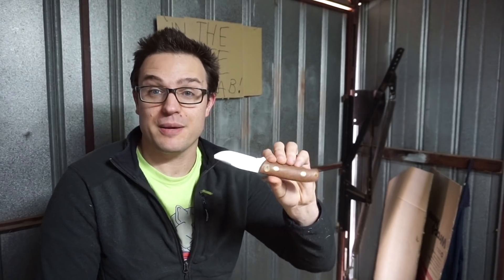What I'm going to do is put a 17 degree polished edge on it. I reckon I'm going to go to a 0.1 micron strop, and we're going to see what this steel does when you really give it a red hot go. Let's see what Dozier's D2 can do from his Arkansas plant. He's just known as a kind of flagship D2 treater — it's his specialty. A bit like TM Hunt's O1, when someone does the same steel a lot, they kind of get about ideal at it. So that's the lore so far. We'll see if the reality walks with that. Let's do it.